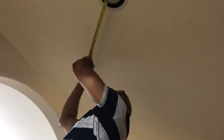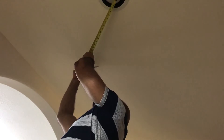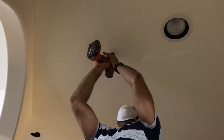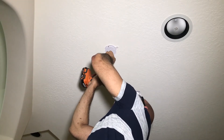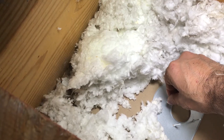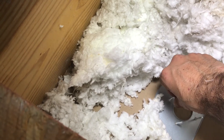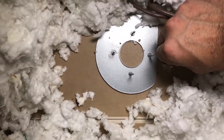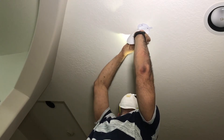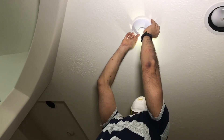I actually got two of these access points. The first one I'll be mounting on the ceiling on the second floor. Once I identified where I want to place it, I started drilling small holes to put the screws into the bracket, then put on the bracket and put the screws in all the way. I then went into the attic and started mounting the back plate. The back plate is only necessary if you're ceiling mounting it rather than wall mounting it — in this case I did need it and had to put the screws on from the back. I ran an Ethernet cable to this location in the attic and then drilled a small hole to feed the cable through the ceiling. I then went back downstairs, put the cable into the access point and mounted the access point on the bracket. Shortly after I saw a light blinking on the access point, which meant it was getting power, so all the cable run was successful.